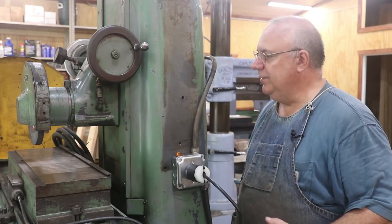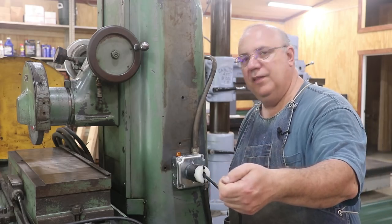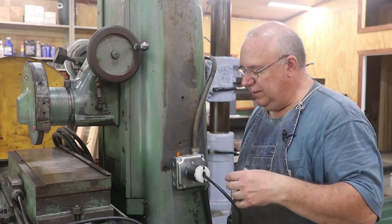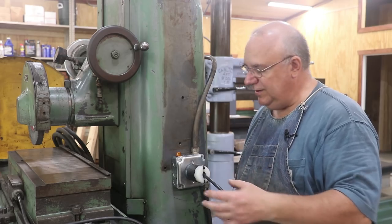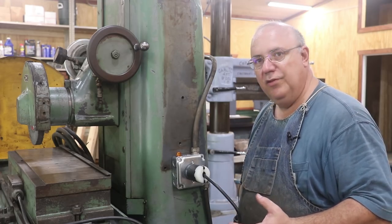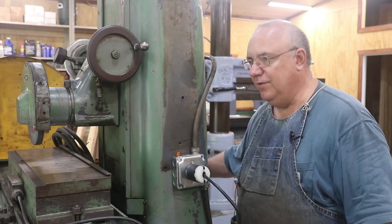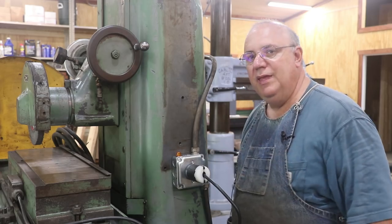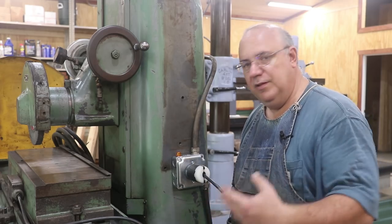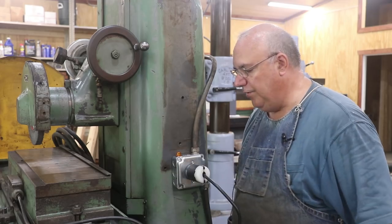When I first set this up, I put a smaller box on the side with the rectifier inside, plugging it into a wall outlet for 120 volts AC input, which then converted to 110 or 120 volts DC for the chuck. I went a step further and took the box off the machine, mounting it inside my electrical cabinet. It was such a small piece it was very easy to fit inside. I was also able to feed the voltage right off the machine's existing power, eliminating the need for another wall plug.